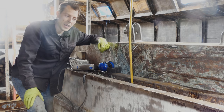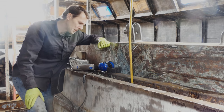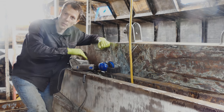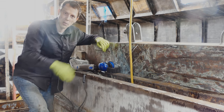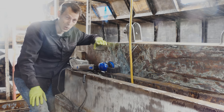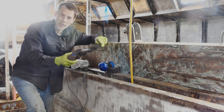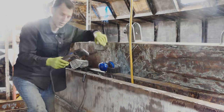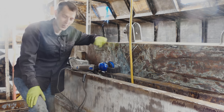All the loose flakes — that's really mostly what I'm concerned with. After I do this, I'll go through as best I can with some kind of sander. Probably I'll use the disc on one of the angle grinders to get down in there and sand down the inside as much as I can. But I know for sure that I cannot reach all the way with the angle grinder. With this one, I can hold the end of it and I don't need a lot of force, so it gives me an extra 10 to 12 inches, which I think is just enough to get to the absolute middle.